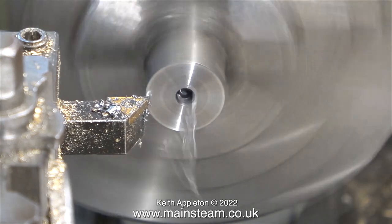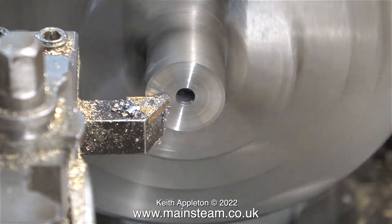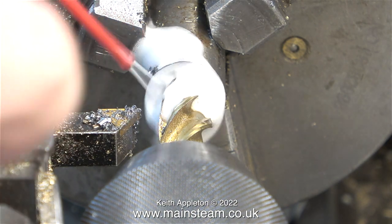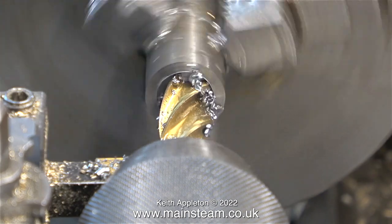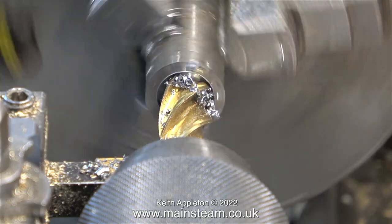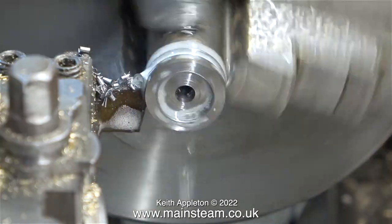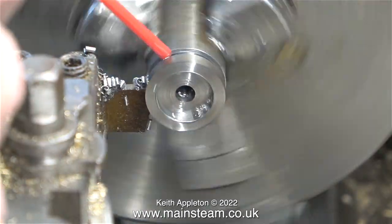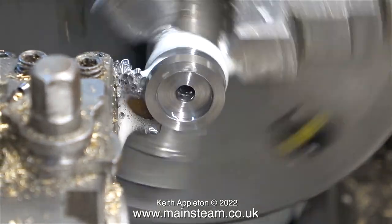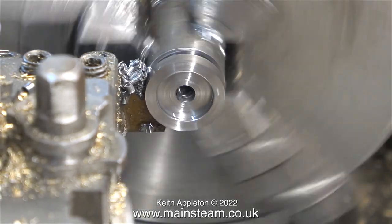I'm facing across the front of the work to make sure it's perfectly flat, because when you use a parting tool they can wander and you may get a domed appearance. I then repeated the counter bore using a half an inch diameter milling cutter. As you can see it's wandering about a bit, so I gave it plenty of lubrication to make sure it cuts cleanly. This is not the best way to do the job — I should really use a boring tool for more accuracy — but there's no point, as this is only a recessed washer as a temporary measure for a blade guide on an old bandsaw. If this is successful I will remake these parts in silver steel and then harden them.